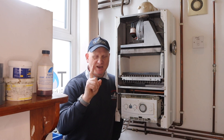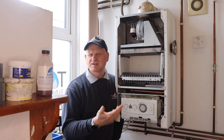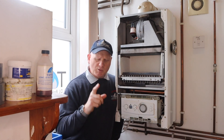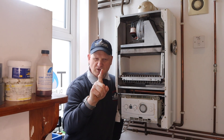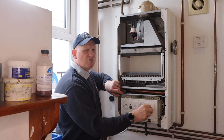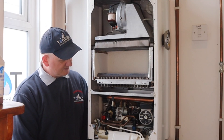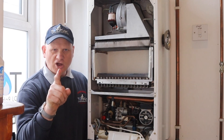What we're going to be doing is looking at the general sequence of operation for combi boilers, and we're going to be using this boiler — this is an old Glowworm CI atmospheric combi boiler. It's not pre-mixed, but even the pre-mixed ones pretty much go through the same sequence; some of them just don't have the same components. I'm going to turn it on and you can listen to see what you think is the first component that comes on. So it's turned on at the plug, turned on on the timer, turning it on at the on/off switch. That's called the pre-purge mode.